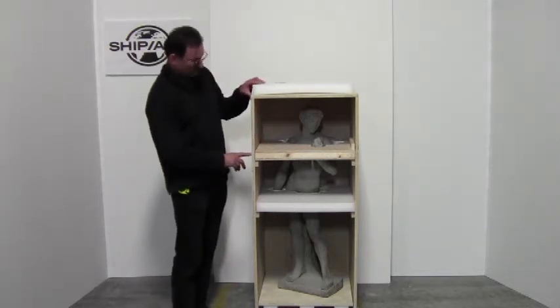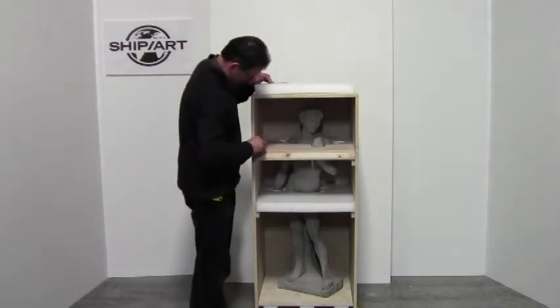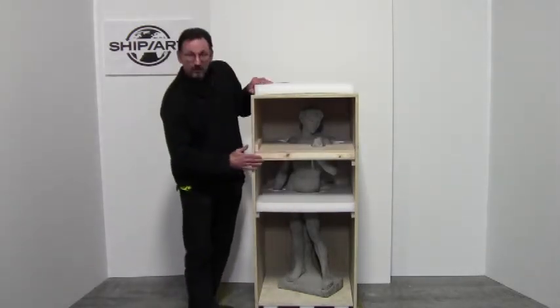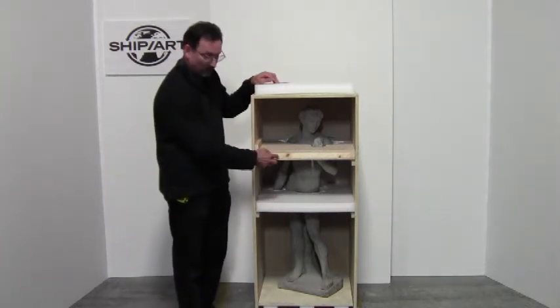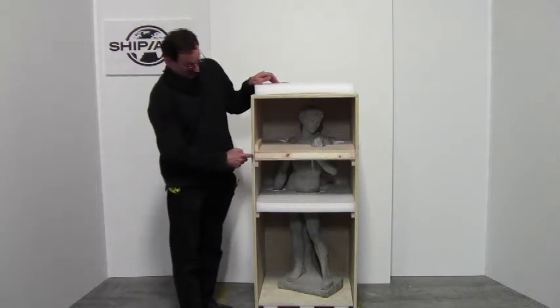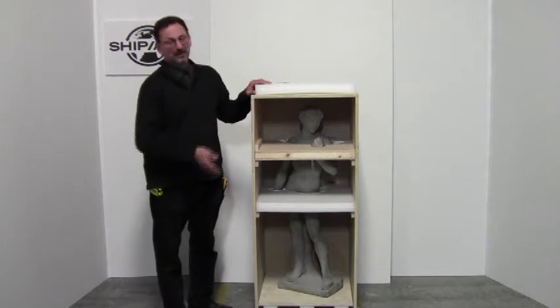So in this case, you might actually be going through, finding your middle, pre-drilling a little bit, and lagging in. Or in some cases, if it's going to travel some, you might actually be bolting and putting bolt plates here, possibly even recessed into the side of this. So you can replicate it basically.